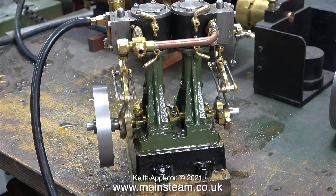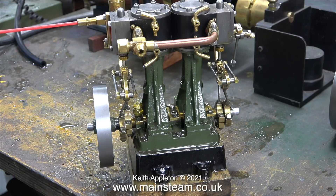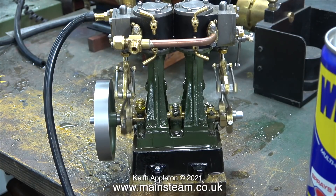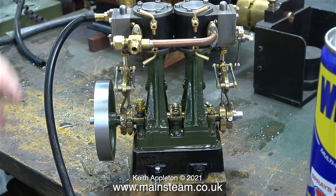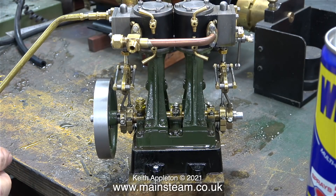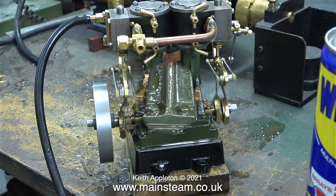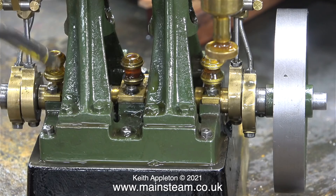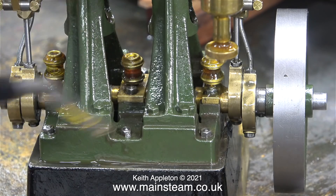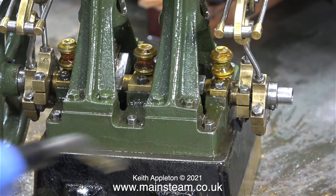In this clip I'm running the engine on compressed air, first to blow away the water. After this I inject some WD-40 into the inlet, then reconnect the air line to blow the WD-40 through the cylinders. The final part of this procedure is to put some steam oil — not lubricating oil, steam oil — into the cylinders, then reconnect the air line and blow that through. Now I've re-lit the burner, and while I'm blowing away the surplus water and oil using my air line, you can see I've refitted the three glass oilers without the extension cups.